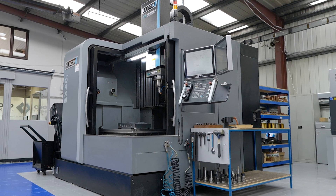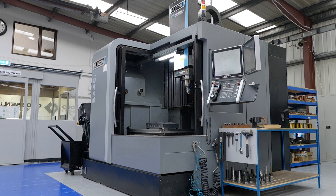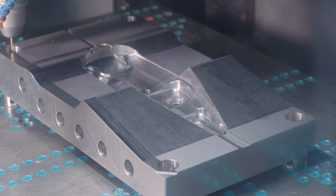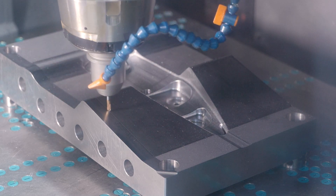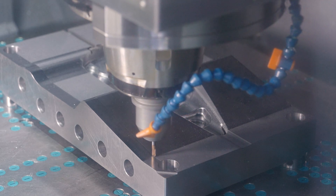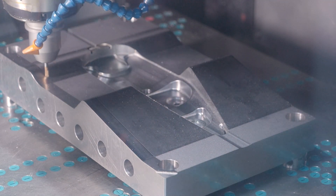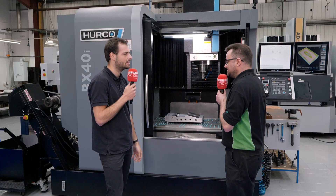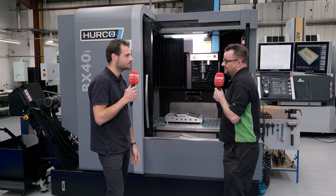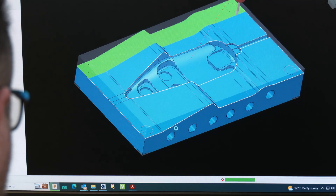It's mainly just machining it to the customer's specifications, whether roughing it and leaving material on for a blasted finish, or whether you have to machine it to a really fine finish. It just depends on what the customer's looking for. The shutout faces have to be 100%, and we would be cutting on the angles with maybe minus 0.02 of a millimetre aside just to get the mould to shut out.